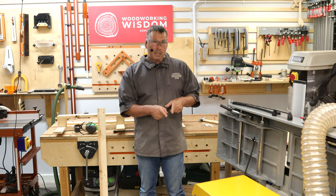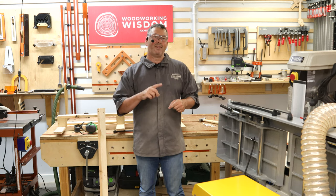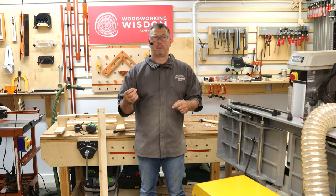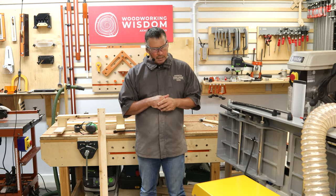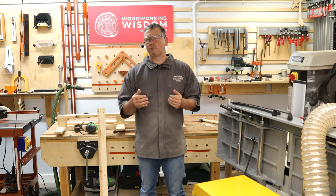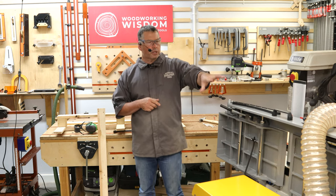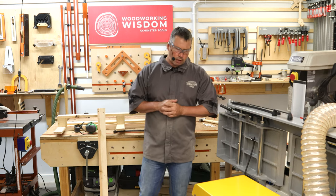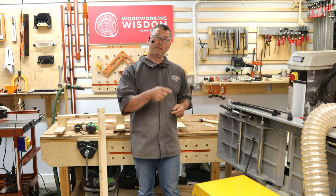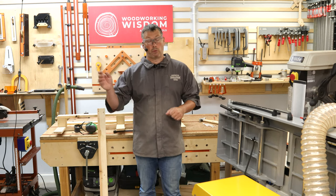I'm going to set the 17mm first. Now, that's the thickness currently of those boards. And then I'm going to take small, probably a millimeter off at a time, because they're quite thin as well, until I'm down to around about 10mm, so about 3/8 of an inch is where we aim to be on this piece. I've got dust extraction hooked up for it here. Ben's going to turn the dust extraction on in a minute. I'll run this board through, get it completely to size, and then we'll mark out before going to the bandsaw.